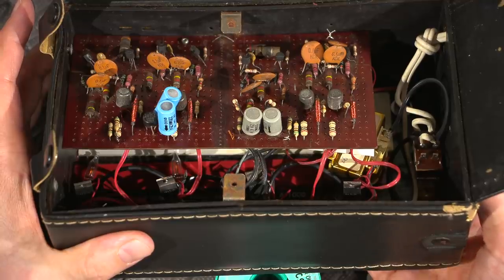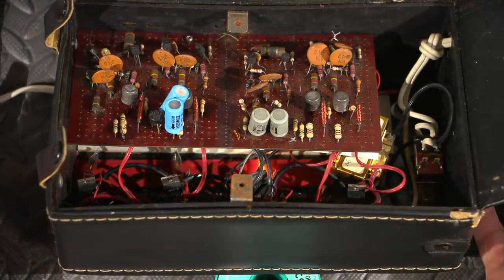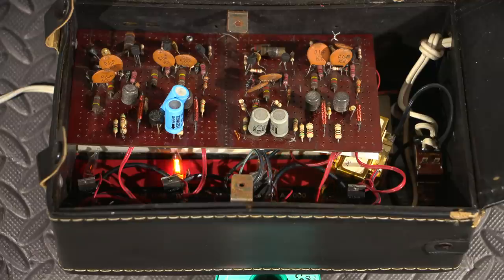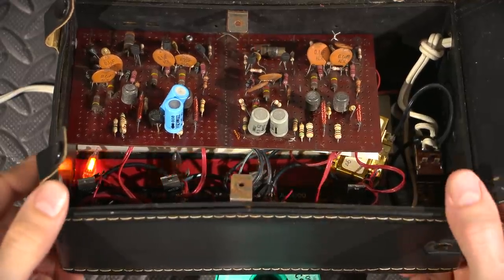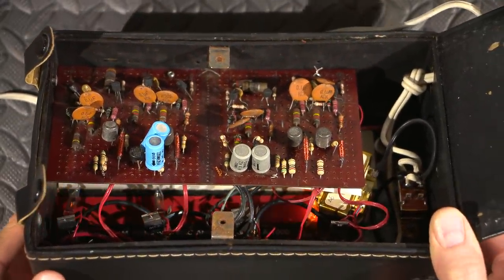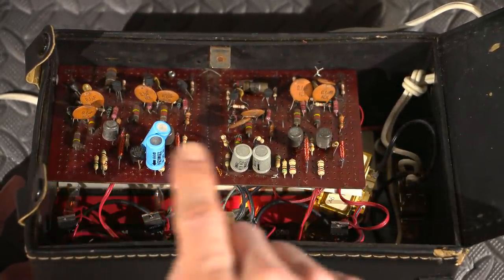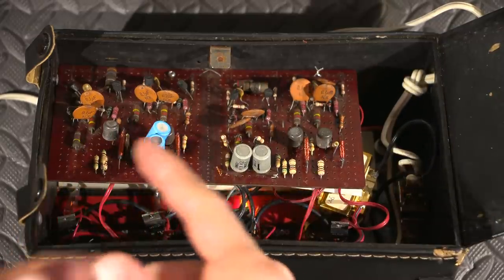Let's try pushing it the other way, turning this on. Look at that! So it is a sequencer. Well, that was really quite easy. You can hear it clicking too. In a modern device you wouldn't actually hear any clicking because they would have opto-isolators. The little clicking is the little reed relays closing and opening under these little magnetic coils that he's wound here — little electromagnets wound around them.